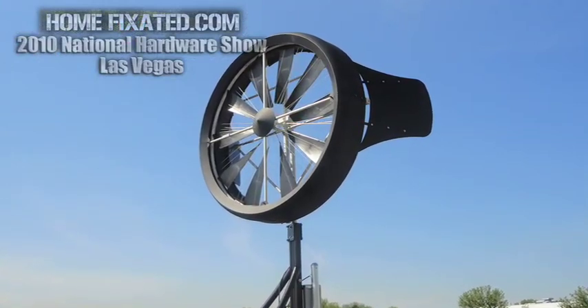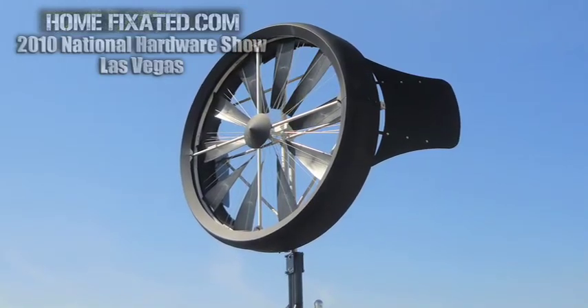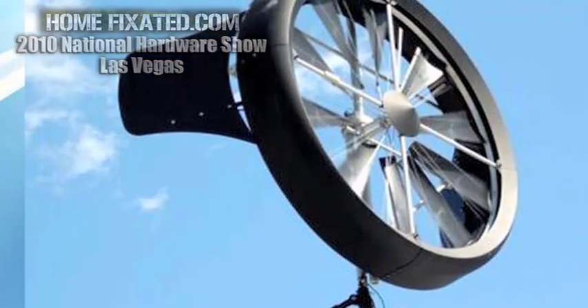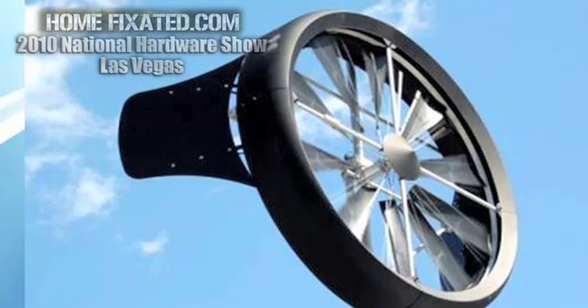We wanted to break that mold and generate energy at lower wind speeds. We took a bicycle wheel concept and placed the energy generation device at the perimeter of the wheel. So instead of a nacelle with a gearbox, we have a gearless wind turbine where the ring around the turbine holds the copper stators, and the magnets are affixed to the bicycle frame itself. As the wheel rotates, the magnets pass through the copper stators — the wheel is floating on the inside of the frame. Essentially, we've turned the entire turbine into a generator itself.